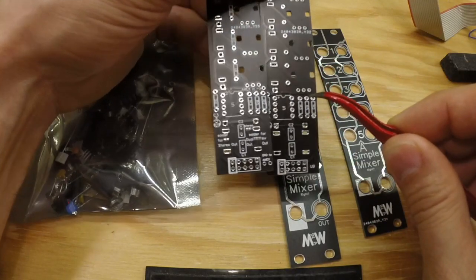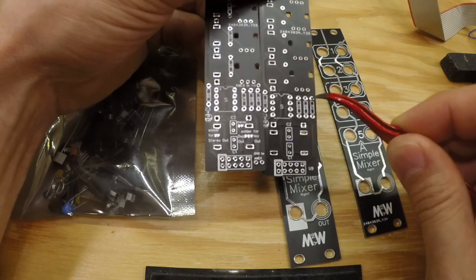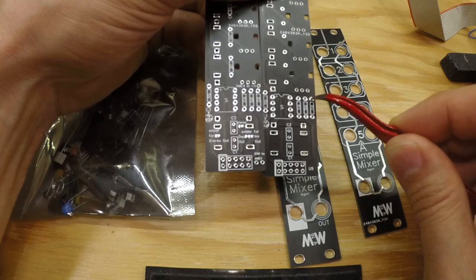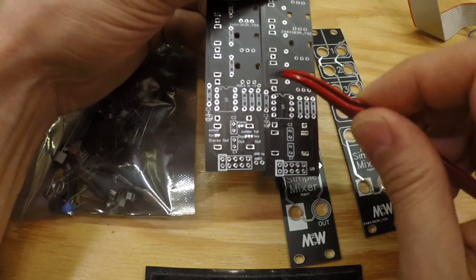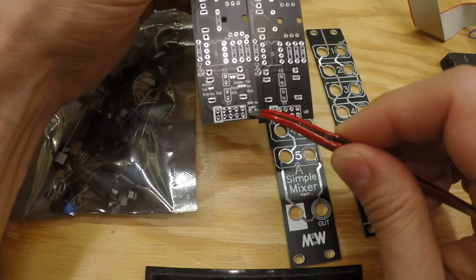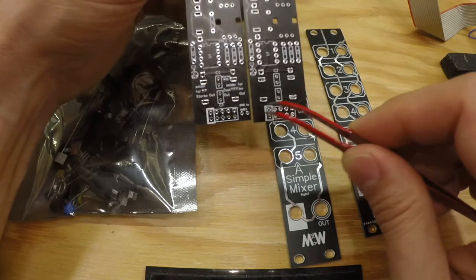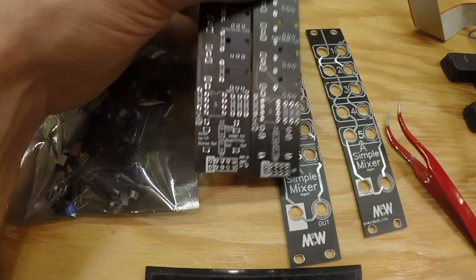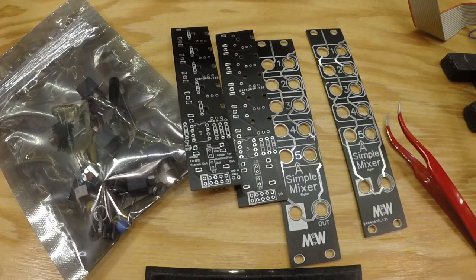If you want to have the AMX and you have the older board, you can just solder the AMX to R2, the top part of that resistor. But on the new one, there's an input for that, and then there's ground outputs down here to get ground to the AMX. Let me show you how that looks.